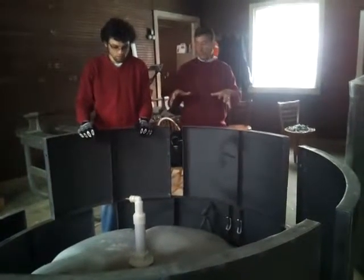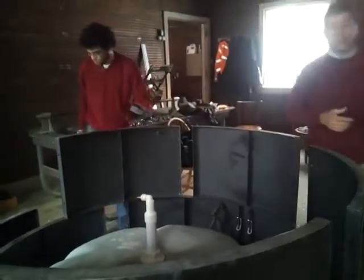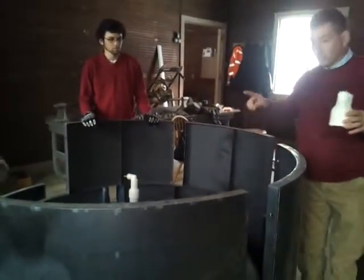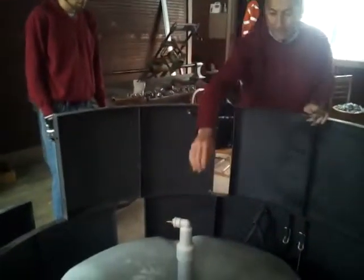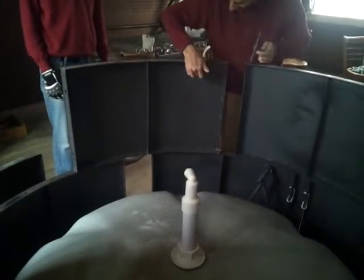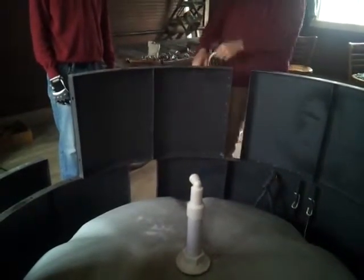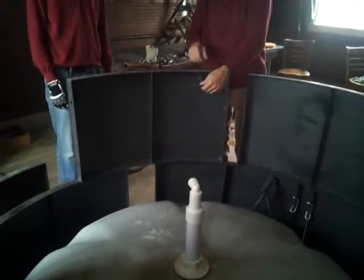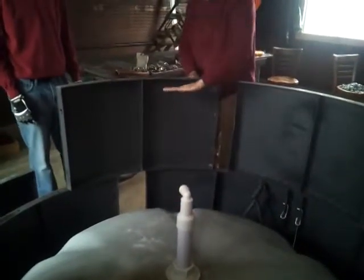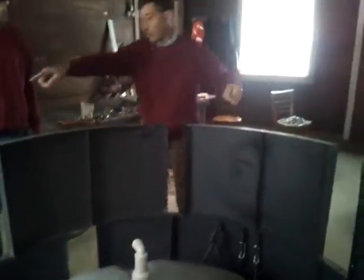And you rarely get to see how it sits in. Obviously with the model it makes a little bit more sense to imagine — but there it is with the anchors. The only other piece to look at is the gas holder here. Twist this — the gas is going to be coming out of a flexible tube, and the gas has to come out here. So when you're pouring the cement, you put this in so that it leaves a hole for the cement to go around, so there's a hole for the tube to come out. And that way the gas stays submerged underwater. When we build this in Brazil, they build a playground for kids and seal it with cement on the top using that mold there.